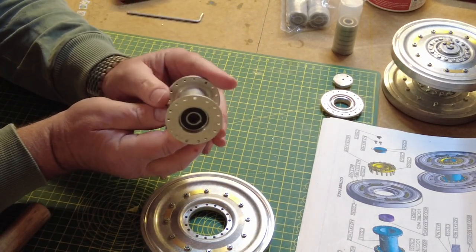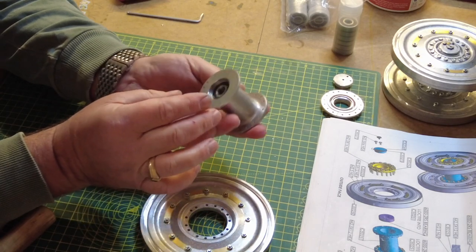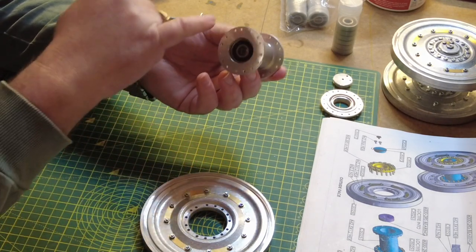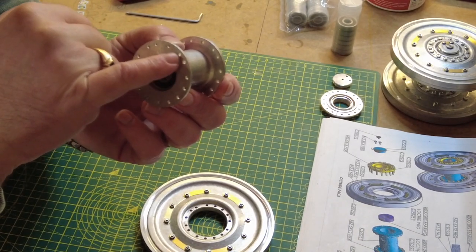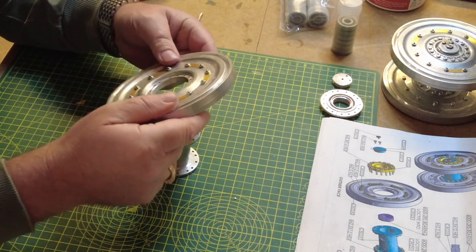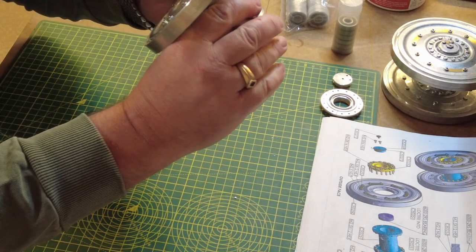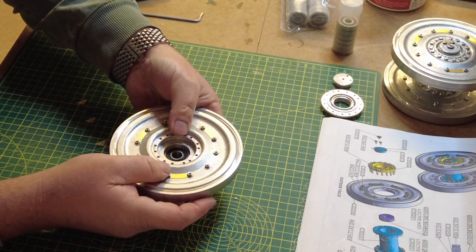Right, so on the actual hub and the spacing of the holes, it's quite important to make sure we line up the three components that we're going to bolt together. The way I'm going to do it is, you've got two holes, a center hole here, and then two holes the other side of that. So basically I've got to make sure I line that up. When I put the wheel on, I'll look for the same pattern, and that's it there. See that that is fine.